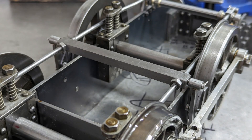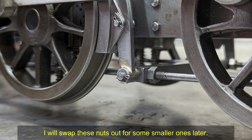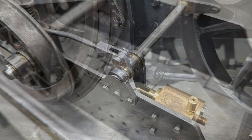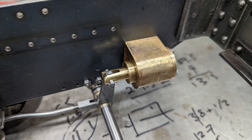Assembly, although straightforward, is a fiddly exercise which requires the removal of the brake hangers to remove the brake beams. Luckily I don't have any of the motion parts fitted, as they would all need to come off. Each of the beams and the associated nuts are then slid onto the rods before reinstalling on the hangers. The rods are then connected to the brake shaft via the adjusters, and the brake cylinder is then fixed to the frames and also connected to the brake shaft.